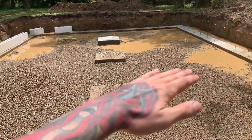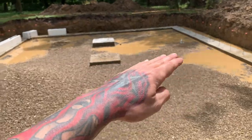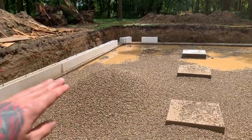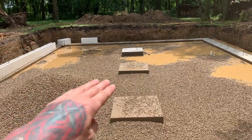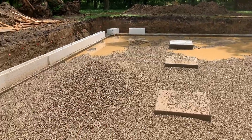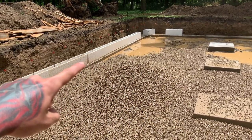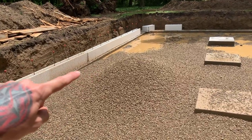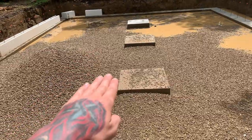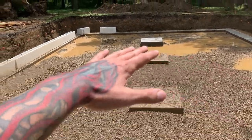Then we're going to do about an inch of sand, pack all that down, then put a six mil vapor barrier, then put our two-inch hard rigid foam, tape those seams together, and that's where our PEX tubing is going to get attached to for our radiant floor heat. The stone and sand should come up to the top of the footers, and these pillars are going to be the top of the concrete floor — roughly six inches higher than the sides of the footers. So we'll have all the stone, sand packed down, vapor barrier, and the two inches of foam sitting on top of the footer. The foam goes into this nice envelope and no concrete under here is basically exposed except for the three pillars. Then we'll have four inches of concrete meeting up here, completely level for the entire basement floor.